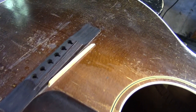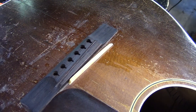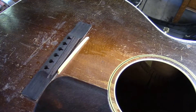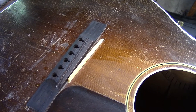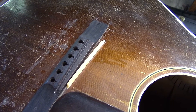No lumber, no chips. Very light stain on that bridge just to make those rosewood plugs disappear. The amazing thing is the X-brace didn't actually let go, so I've opted to put a very thin Sitka spruce veneer on either side of where that brace was drilled through.